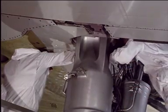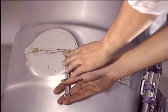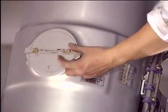Remove the pin at SM5 and the outboard portion of the bell crank lever. Now tie a guide rope to the disconnected link of the shortening mechanism. This rope is used to guide the shortening mechanism linkage during shock strut removal, preventing damage to the bore of the main fitting. Remove the inflation valve access panel.